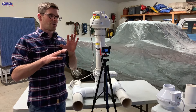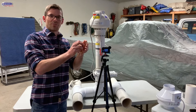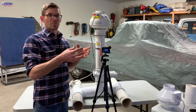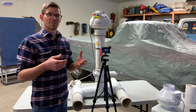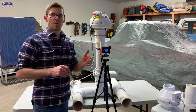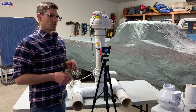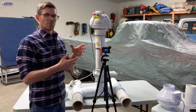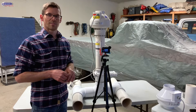It's really helpful when you have multiple suction points where you need to just pull a little bit of air from one spot and maybe more air from another. An example would be a crawl space. Typically we only need to pull five or ten CFM from a crawl space, so we'll usually use two-inch PVC with a two-inch ball valve and dial everything right in, then let the rest of the fan work on say the drain tile or the sub-slab depressurization version of that system.